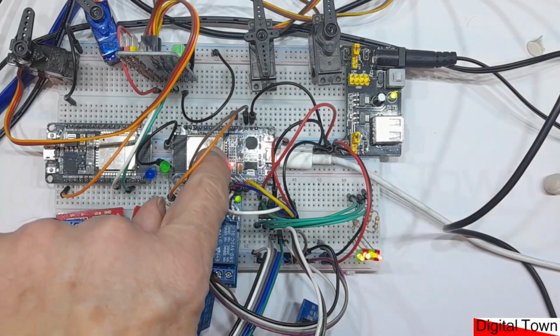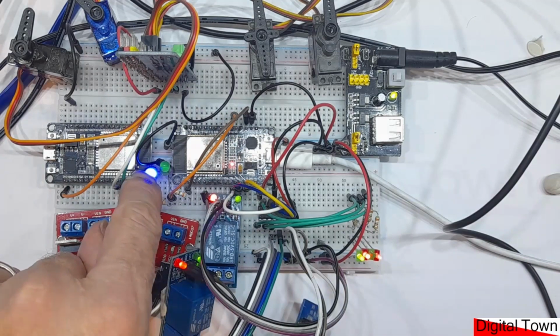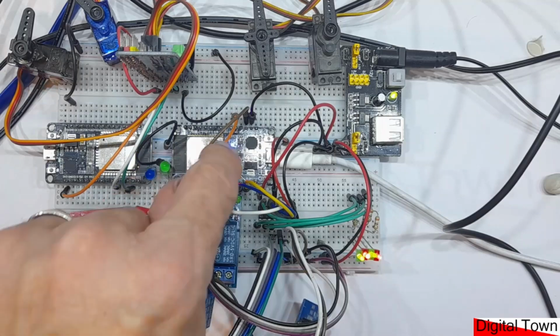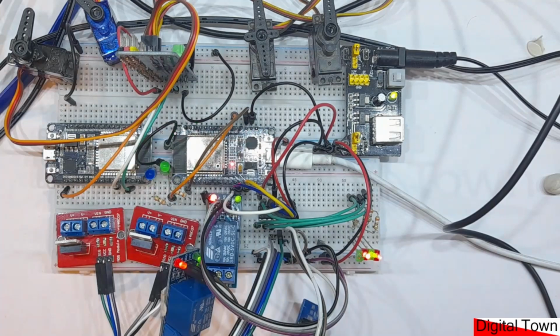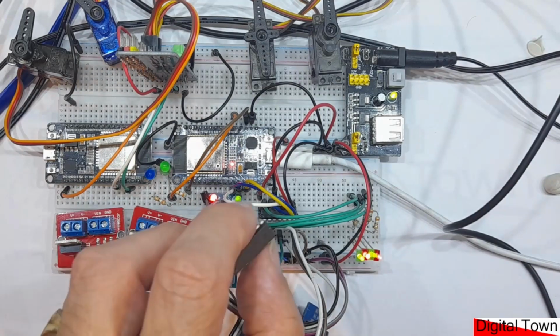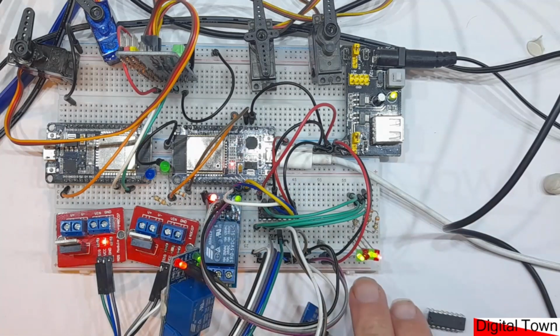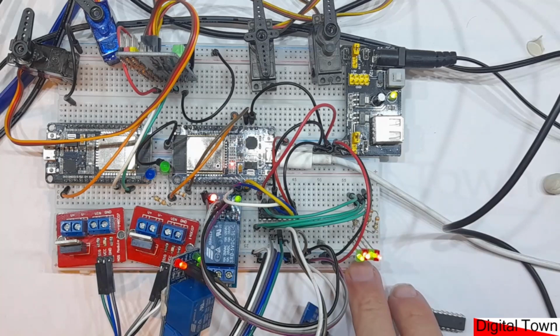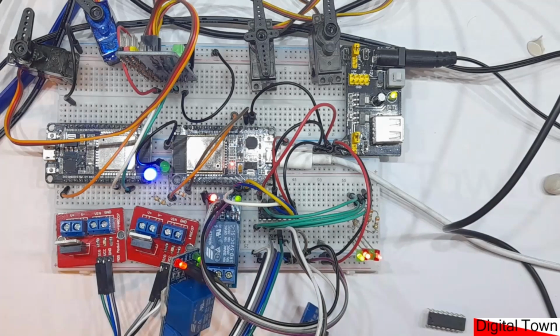So we've got an ESP32 in the middle. I have an LED here and here that are connected to some pins directly to the ESP32, and then I also have a shift register that you can hardly see through the wiring. It's one of these, and I'll explain that a bit more. And then off that shift register I have 4 LEDs running, then I have 2 relays and 2 MOSFETs. And the reason for this is for accessory control.